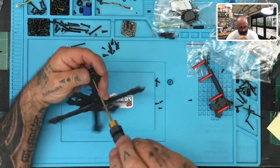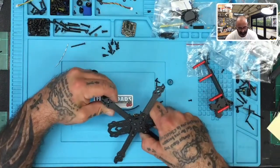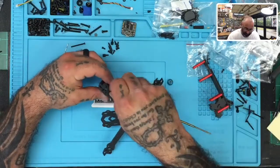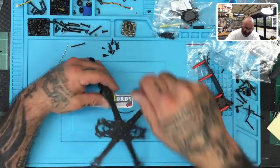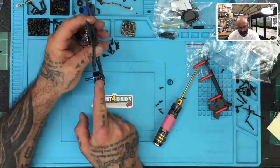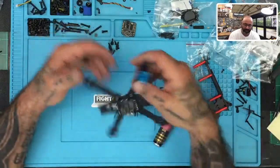But what you want to remember is not to fully tighten the motor, because you have to adjust it and get the holes lined up. So let me do that, there we go. And I'll just take another one, line it up here. You can always inspect visually, and if you see the screw protruding through the metal fastener here and getting near the copper, the screw's too long and you need to change it, okay? All right, this is fine though.